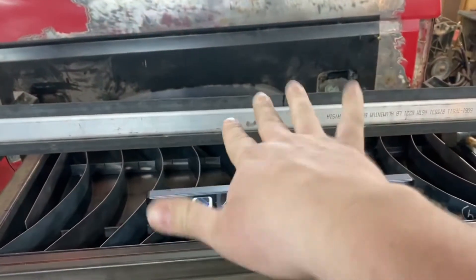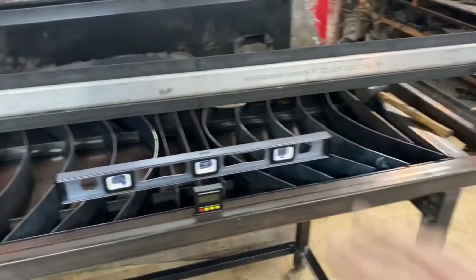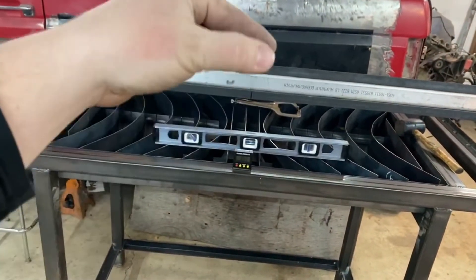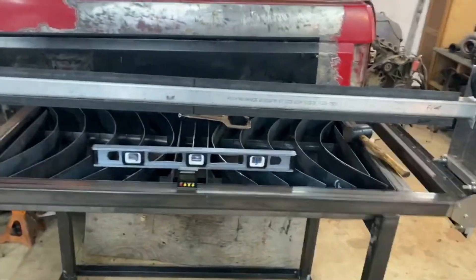I've got the gantry bar back up and leveled it out as best I could. According to this 12-inch digital protractor, I am bang on, and my measuring tape is showing the same thing, so I think I am straight. What I'm gonna do is center punch that hole right there, same on the other side, and throw a pin in there to fix it so I know that's there. Then I'm gonna work on this bar so the same tilt — I can get that thing zeroed as well. Hopefully we can get this thing bolted down.